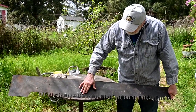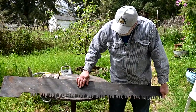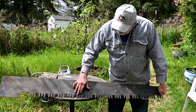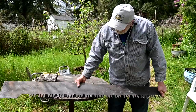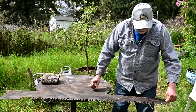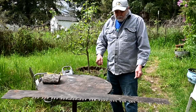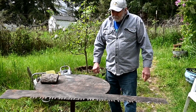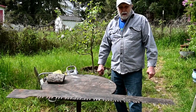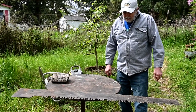And the teeth — you've got a right and a left cutter. You cut the height of these to do the same as a raker. Now the early chainsaw chains didn't have raker gauges on them. The thing that would gauge how fast they would cut is how much down pressure you could put on them. So that was a difficult job running a big heavy unreliable saw — it took a lot of effort to put it into the wood to cut it.